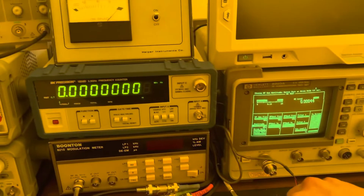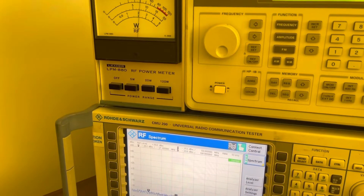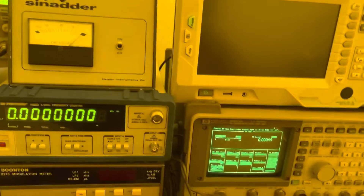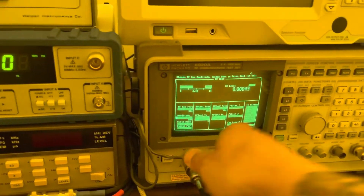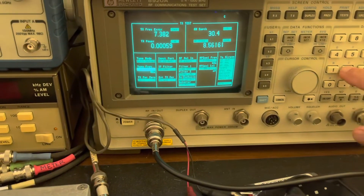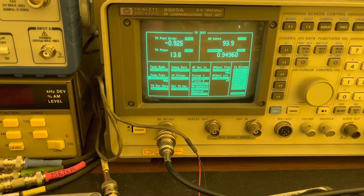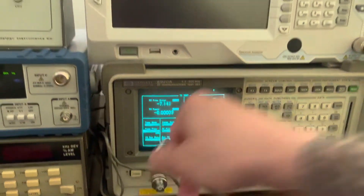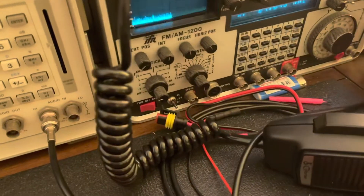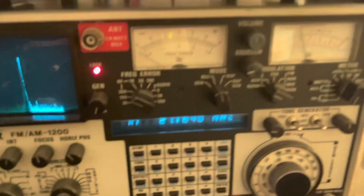Power-wise, let's see what she's doing average on SSB — about 7 watts average. Let's compare all three. Received our transmit test. Let's go to 27.1840 megahertz and see what she's doing. 13.7, so about 14 watts peak, which makes perfect sense. And what's our calibrated IFR 1200 showing for peak? She's peaking out at 15 watts peak. She's showing 20, but this is also calibrated, so I'm going to go off that. She's set up pretty clean.